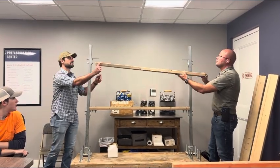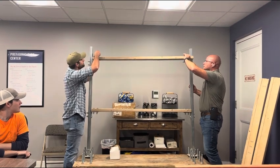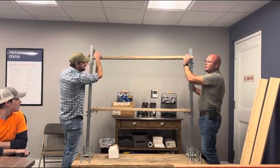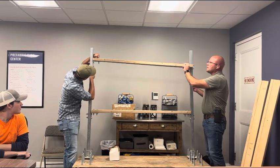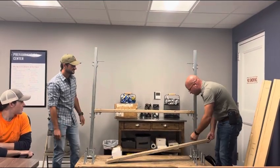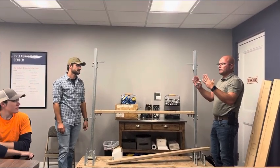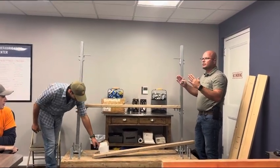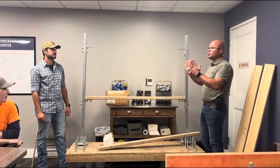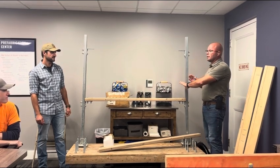We're swinging in the top one. I'm going to let Brandon go because he beat me to the punch — he had his up there first. He already knows. He wants it in front. So he struggles with the bolts because I can't even get mine in line. We're both too tight, or we're both too far on our bolt locations. Pull that off — what happened is when we set this lower one, it drew those top ones in. The only way you're going to make it work — and I've seen some crazy things happen, come-alongs and all that — is to try to project them back out. But all that does is put them in more stress, even if you're ever going to get it in there. So that's both too far. That's a quick demo of that.